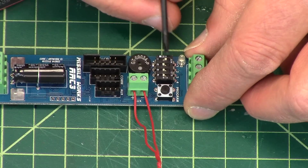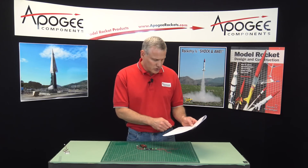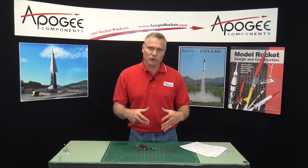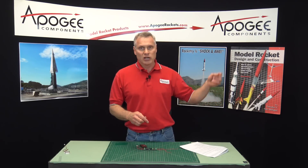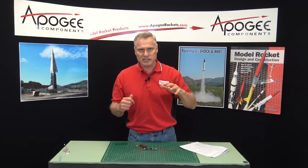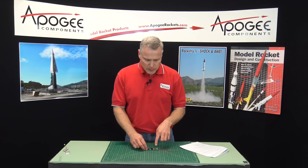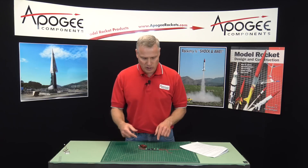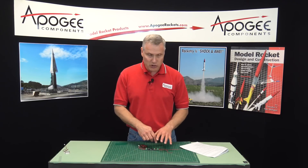With the DIP switches you can control the main and the drogue. You can set the piezo tone — raising it from a low tone to a higher tone. You can set a drogue delay, so if you're using this for redundancy as the secondary altimeter, you can set the drogue to fire after it passes apogee rather than at peak altitude. The reason is so you don't fire two ejection charges at the exact same instant, which could overpressurize your rocket. There are eight things you can do with the DIP switches. If you want to control staging, you need to hook it up to the LCD controller or USB connector to your computer.